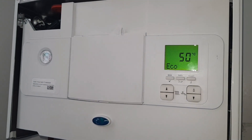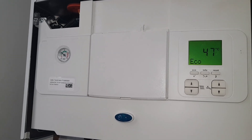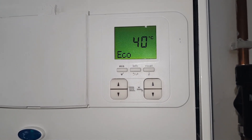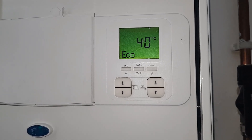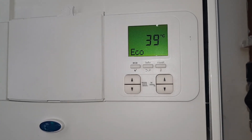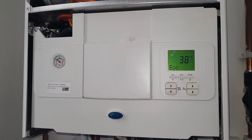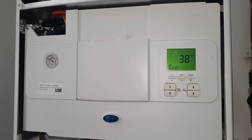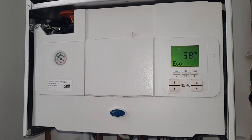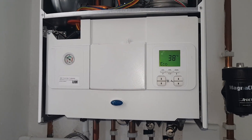We're just turning on — that's the air coming out. That's why I said put a bit more pressure in because you lose some. We're waiting here now to see if that fault code comes back on, and up to now it's not appeared — so that means we've done it. It was the pump all along. All we now need to do is put it in heating mode, get rid of the air in the boiler, let it run on the system for a few minutes. That's it as far as I'm concerned — you've seen the full story on this type of fault and what you have to do. That's going to be it from me and Miles — see you in the next video, bye for now.